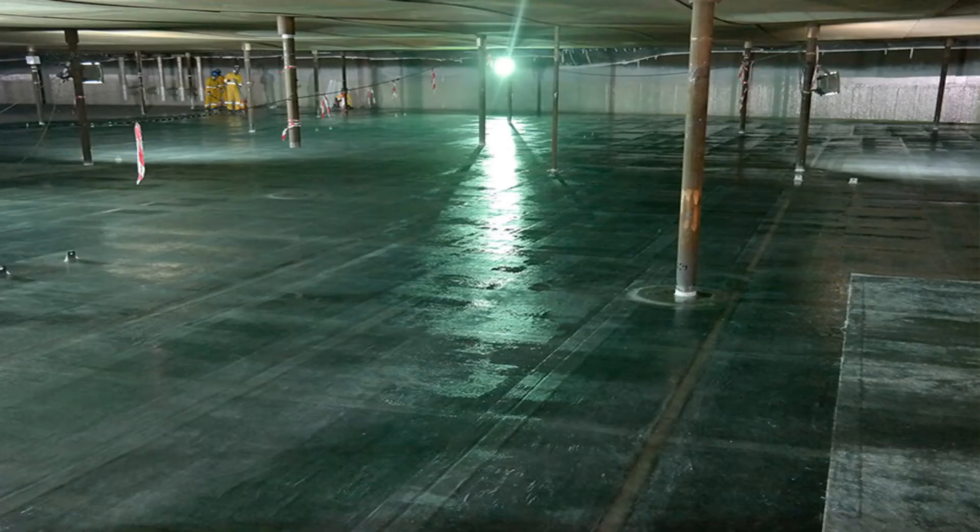This picture shows the fiberglass lining application in an external floating roof crude oil storage tank. In crude oil storage tanks, lining will be applied in the bottom and first shell course, because the crude oil contains highly corrosive water which contains hydrogen sulfide and other solid contaminants.